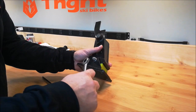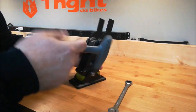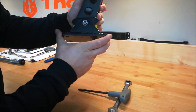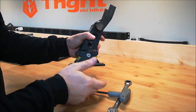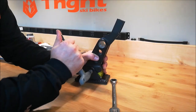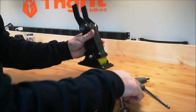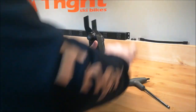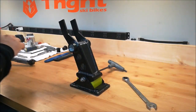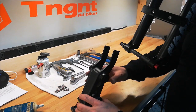I'll loosen this SRS just so you know what it's like in case yours is loose. Back the nut off just slightly. Take a 6 millimeter hex wrench and rotate the Allen side 180 degrees — now you can see that it is loose. You could then fully disassemble this if needs be. To tighten it, simply rotate the cap screw again 180 degrees back. Now it's in the tight position. Tighten this nut up — you may need to hold the cap screw. Grab the torque wrench and torque it to the specification.